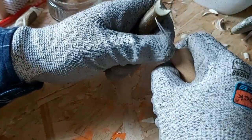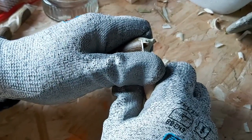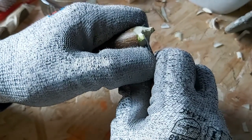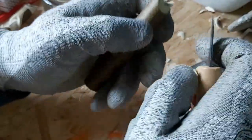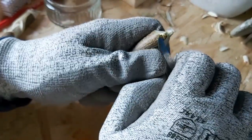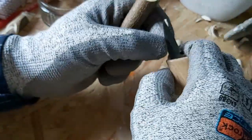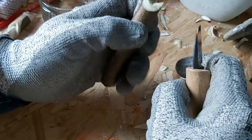We've done the ears — now we're going to cut them in ever so slightly, making a nice stop cut and then carving in small so you're getting that pointed ear look of the owl. I'm going to take the bark off there, being careful not to take too much of the ear off at the same time. It's worth noting I am wearing cut-proof gloves — you may have noticed I was already sporting a plaster from a little cleanup on another project. I thought I'd be alright without gloves, but you can guarantee you won't be. I'm nearly on a first-name basis with the nurses at my local minor injuries, so it's probably best I wear gloves.